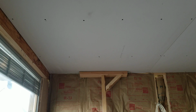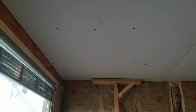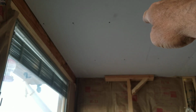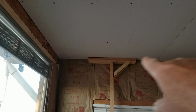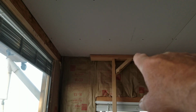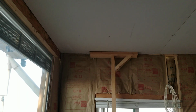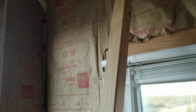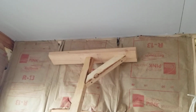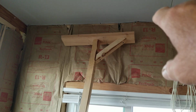Now I can grab the panel and stand up and put my hands over my head, and I lift the panel on the same slant it was sitting on here, and I go over the top of the 2x3 that would be fastened to the wall over there. Now, let me not confuse you here, this crutch would actually be down like this. So the 2x3 would be above it.